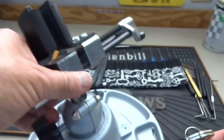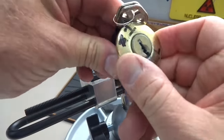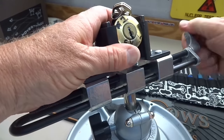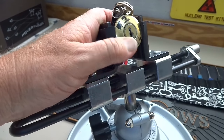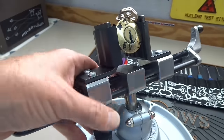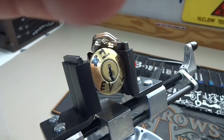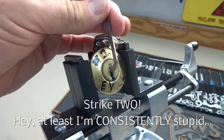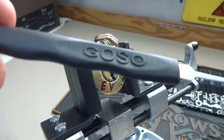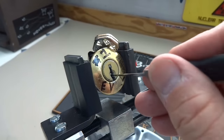It's got this high security tape so it must be extra hard. Let's see if we can get this thing clamped up without moving the key — I'll slide it around the top and clamp the face of it really tight so we don't mash the key and it holds firm. The thick Peterson pry bar will work for this Schlage keyway, and I'm going to try this — the medium hook, 30,000 — it'll fit in this keyway no problem.